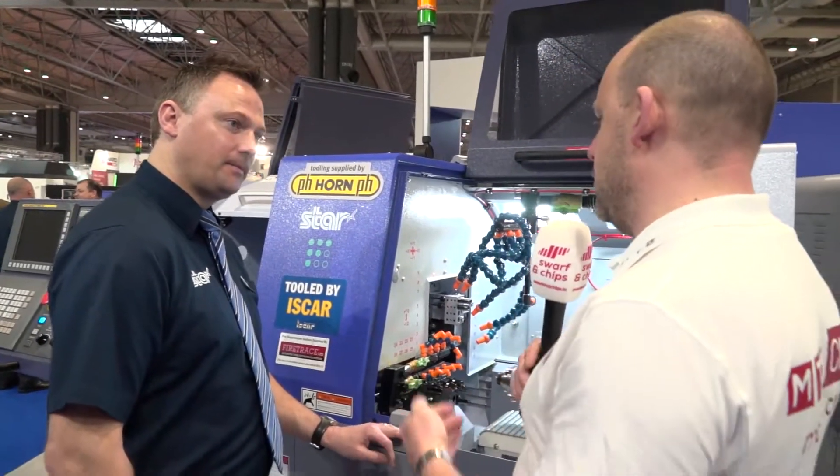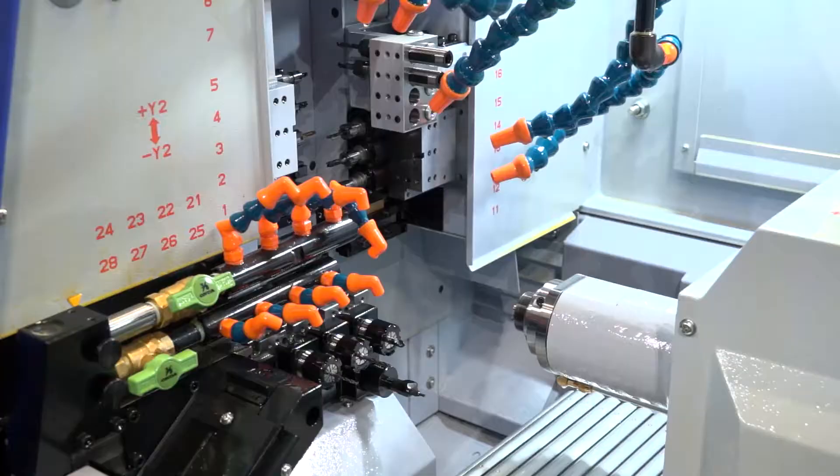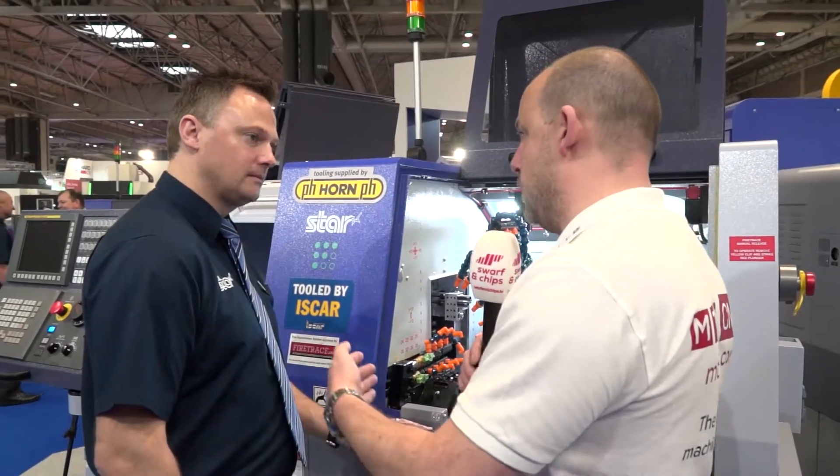Twin-platening — is that just operating on the main spindle? Yes, so you could do balance turning, you could do balance milling, multiple operations. So if you're balancing, that essentially could half the cycle time of a machine in operation? Yep, so say for instance you're doing a hexagon, it's only three passes.